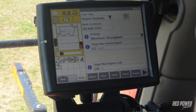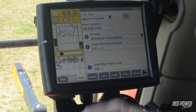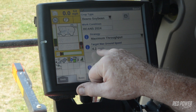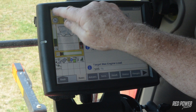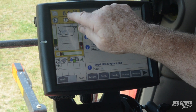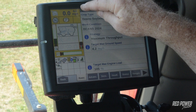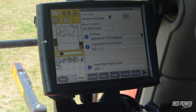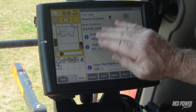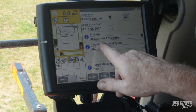From that point forward, all we need to do is engage the feeder and separator. Once those are running and we're moving into the field, we move our hydro lever ahead. When we hit the engage button on the multifunction handle, it's going to work us up to that speed depending on the load of the combine. Once we activate this button, the grayed-out icon turns black. We'll show the target speed right here — so the 4.2 comes up. And then this speed gives us our actual. Let's say we're in really heavy crop and it's only letting us go 3.8 — it would display 3.8, with 4.2 still shown as target. As we move through the field and load decreases, it walks us up to that particular speed. The handle can be anywhere you want in the quadrant when you hit the engage button and it's still going to work toward our target speed.